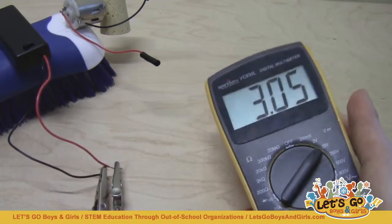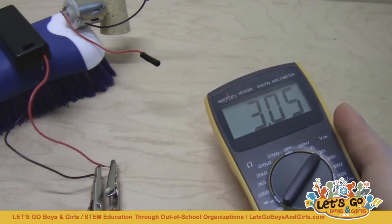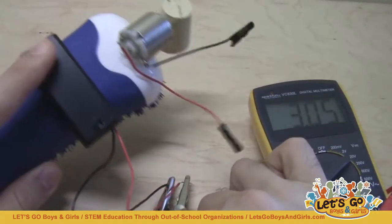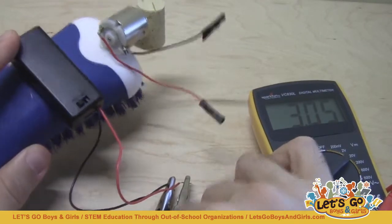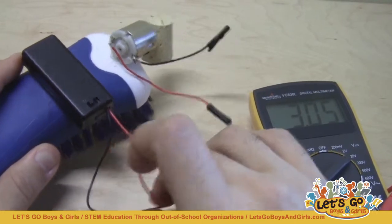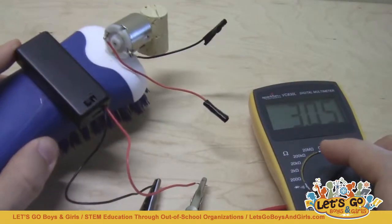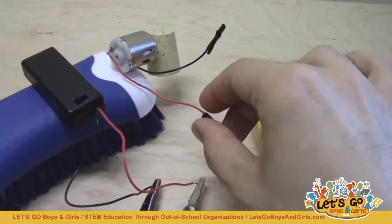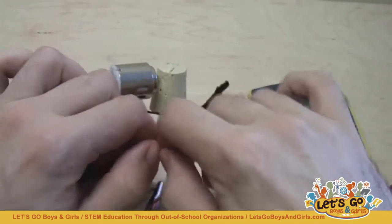So if you do that and you turn the battery pack on and you get nothing, or a lower voltage, if you're getting a lower voltage that's not 0, that probably means the batteries are just actually dead and need to be replaced. If you're getting 0, that probably means they either put the batteries in wrong or the battery pack itself could be defective. Sometimes these are cheap and poorly assembled, so there are a couple little internal metal springs that can come loose, and the batteries can be perfectly fine, but there might not actually be a good electrical connection to the wires. So we have seen that happen a couple times where I look at a kid's robot and everything checks out fine, and these connections look good, but I open the battery pack up and it actually turns out that something jiggled loose in there, so it wasn't their fault, and the kids can get kind of confused.